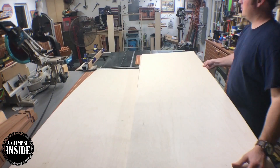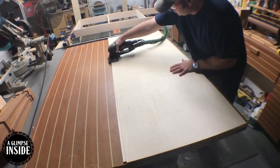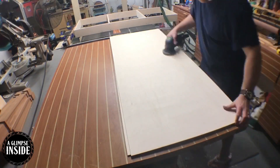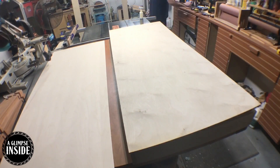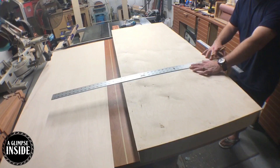This is made from Baltic birch plywood, one quarter of an inch in thickness, and it fits pretty well. I cut it a little bit oversized, and before I flush trim it with a router, I like to do some pre-sanding to make things easier down the road. No screws necessary here — I'm just gonna use glue and brads, quite a bit of brads, and there's enough surface area for the glue to be just as strong as I'll ever need.